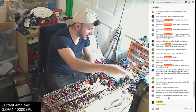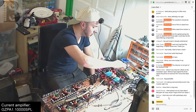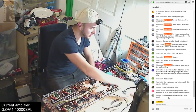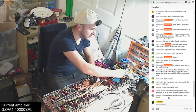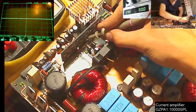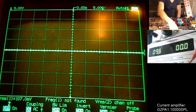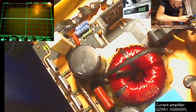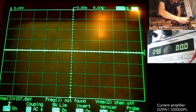Let's take a look at the modulator. Removing the inductors from the circuit again so we can hold the amplifier on, let's probe the modulator output pin from the driver board. Setting the scope to a much lower voltage — around five volts per division — and turning the amplifier on. There is some DC on one pin, but I'm not sure which is which. Let me find the modulator pin — there it is. Cleaning that up a bit, there's some noise, probably due to how my scope is grounded.